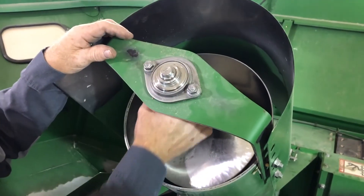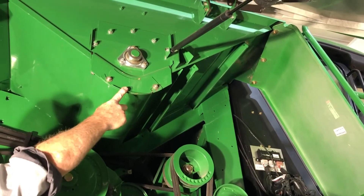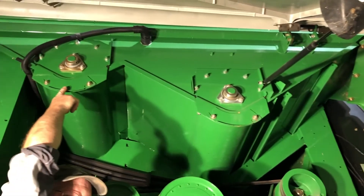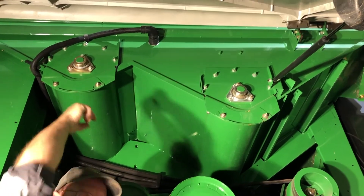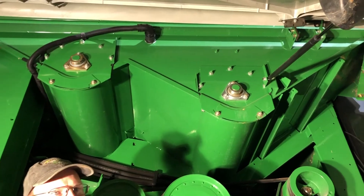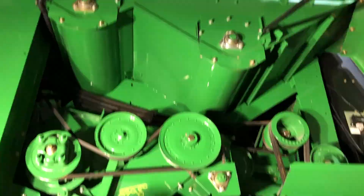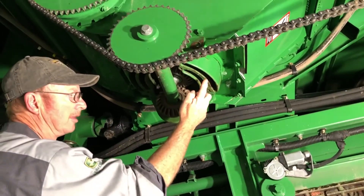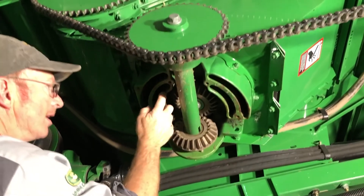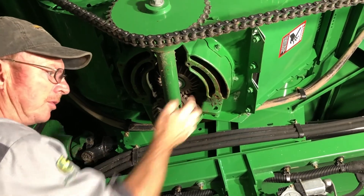Check your bearing and make sure it's alright. This is the grain tank front auger drain, and this is the rear grain tank auger drain. Make sure those are open if you're washing the combine, but don't leave them open when you go to the field — they'll let lots of grain out. This is where the vertical auger drain covers go; they're removed right now, but there's one on the front side with three bolts to hold it on, and a rear one with two bolts.